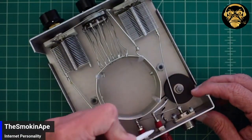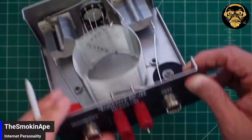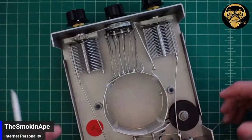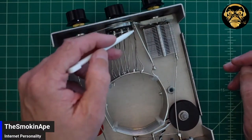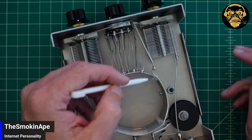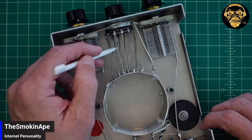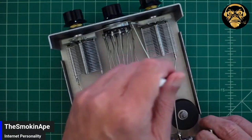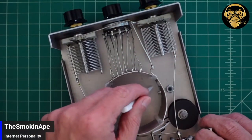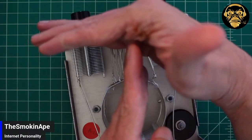There's also a split here, so if I wanted to use a single wire or a balanced line, it's tapped there. Now in between the connection — the top of the T between the two capacitors — I have this wire that comes off and goes into my induction coil. The coil is connected to the various values on the rotary knob. Down here at the bottom, you can see my coil goes to ground — so this is the bottom of the T, and those two parts are the top of the T.